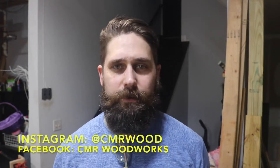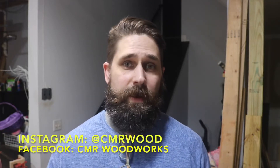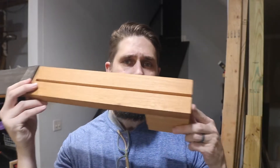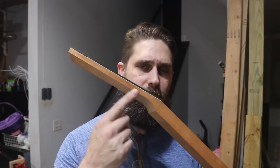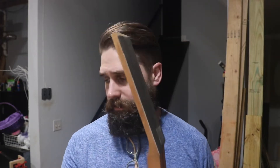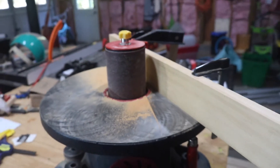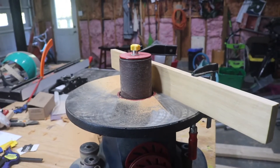What's going on everybody, my name is Chris, welcome to my channel. This is Part 10 of my acoustic guitar build — it's the first guitar I've ever built and I'm making it from scratch. Last time we made the neck in rough form. I was just thinning out the back part of the headstock, up to where the nut comes in. I rigged up my oscillating spindle sander with a little fence since I don't have a drum sander.